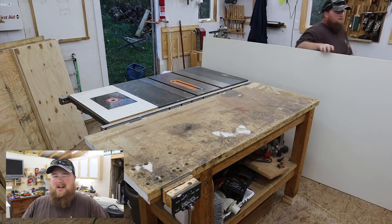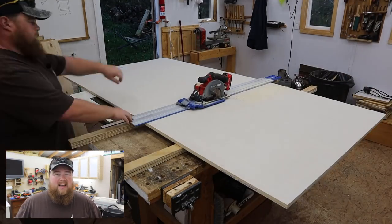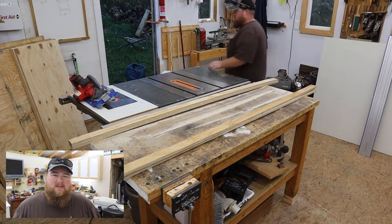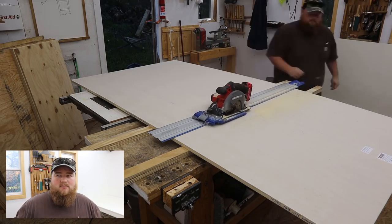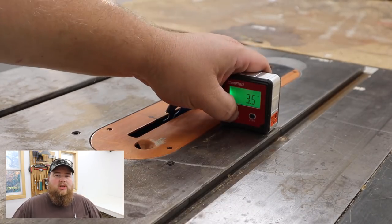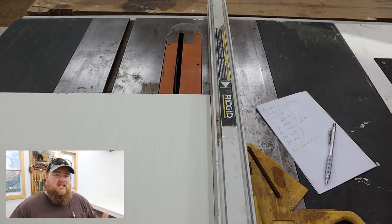I started off this project by taking my two sheets of plywood and cutting them to approximately 61 inches in width and leaving the other part 48 inches. This gave me one the top for my table and two other pieces of good enough size to rip and cut all the other pieces from. This is not Baltic birch — I couldn't get that — so this is the next best thing from the big blue hardware store in my area. It's three-quarter inch plywood with multiple laminations, which was the number one thing I was looking for.